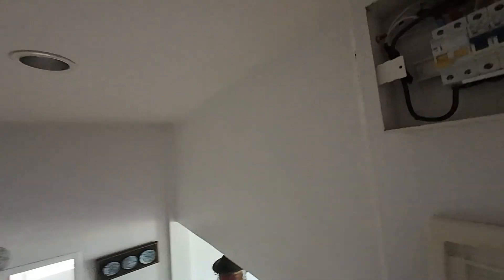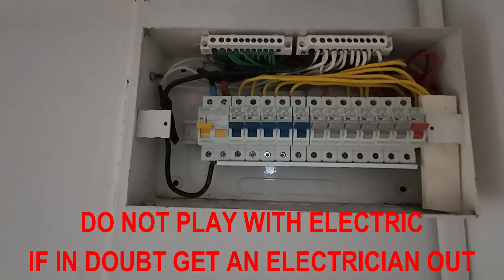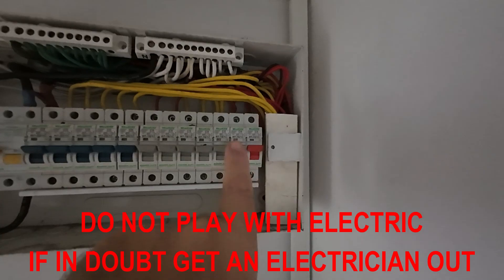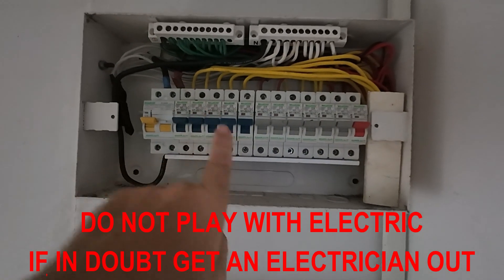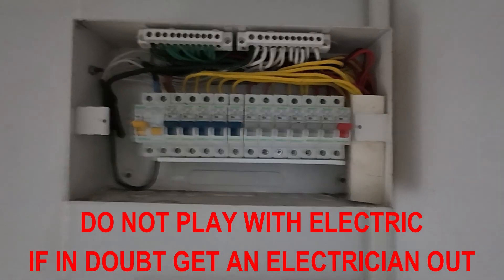It's a brilliant piece of kit. It's switched off the RCD, which is exactly what happens if you have any faults in your house - it trips the RCD. All you need to do then is flick it back on and everything's working again. If you have a problem on one of the fuses, turn everything off, turn the RCD back on, then gradually switch circuits back on one by one - whichever one trips the RCD is the faulty circuit.